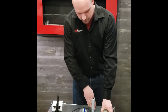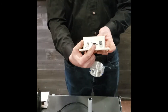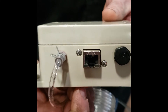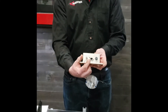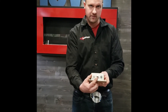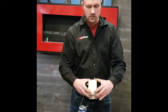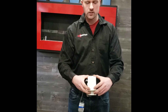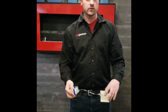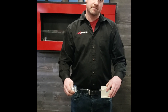That's it for the installation. Like any Ethernet device, there are two LEDs on the bottom of the PT Level Wired. Once you have it powered on and fully connected, you should see an always-on orange light, and the green light will blink every once in a while indicating network traffic — that means it's successfully connected. Finally, there is an ID right on the top of the device and also in your instructions. That is what you use to connect this device to your account at www.ptdevices.com. Thanks for watching.